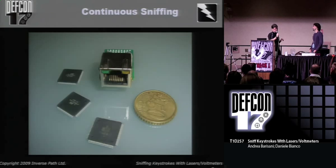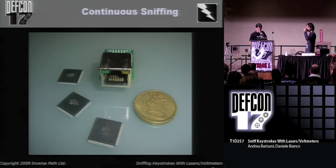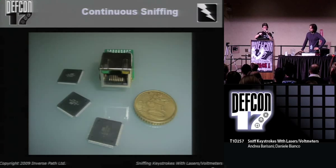There are crappy ones and better ones. Basically, you can program them if you want, but there are some of them which open a port for you, so you can connect with Telnet to it, and it will stream back the SPI data to you, which I think is kind of handy. Or if you want, the converter can be the client and you are the server, so it will try to connect to you and stream the data back to you, which is really great.